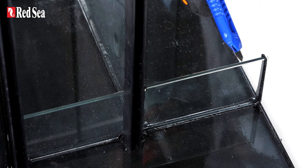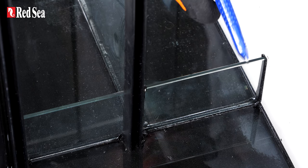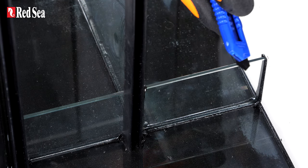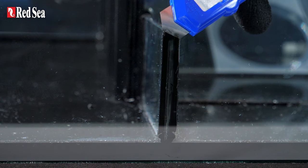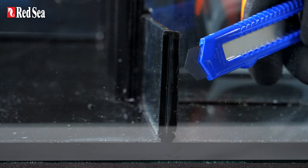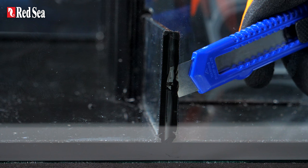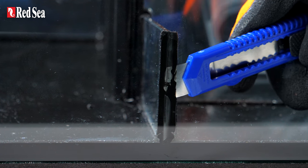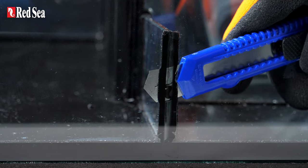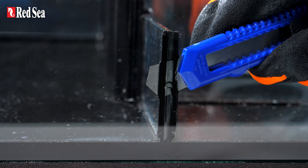To work with the very thin blades, always work with the minimum amount of blade extended at any one time, and always make sure that you lock the blade in position so that it stays where you've put it. There are some parts where you can come in nicely from the top, and there are others where you have to work your way in from the side. Where you work your way in from the side, just press in a small amount, release the lock on the handle, and extend the blade a little bit more, then push in again until you penetrate the whole part like that. And now we can just easily slide up and down the join.